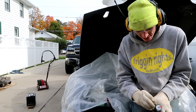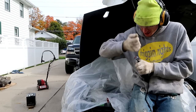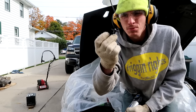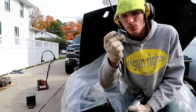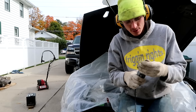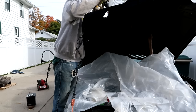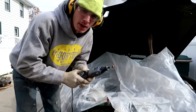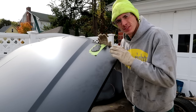At least I have my first hole cut out. Now I got to clean it up, so I'm switching bits — going from a cutting wheel to a grinding stone. I always put these somewhere idiotic and then I step on them and they're no good. These things aren't cheap — they're like 12 bucks a pack and you only get three or four a pack, so you got to be careful. The grinding stone is actually doing much better than I thought it would. I'm happy to say that I have the first one installed. The new Dremel did a wonderful job.